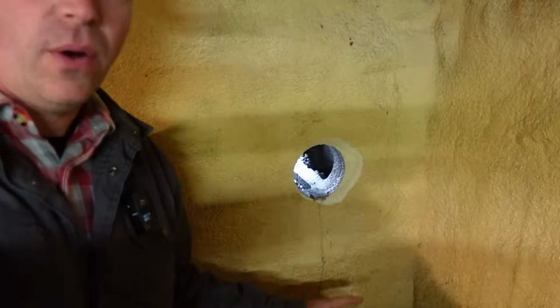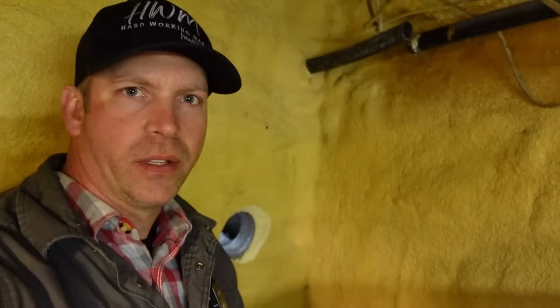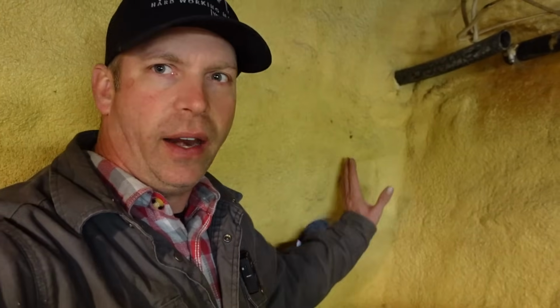I just got home from work and my buddy's already got the trench dug. Rachel's been getting the footage of it. I had to pick up a 5-inch coring drill so we could core this out because I've got block. We didn't want to crack it. I was going to just use my hammer drill and the chisel bits for it, but he said I could crack it. We're going to feed the pipe through, feed the wire through, and then we'll get back to work outside.